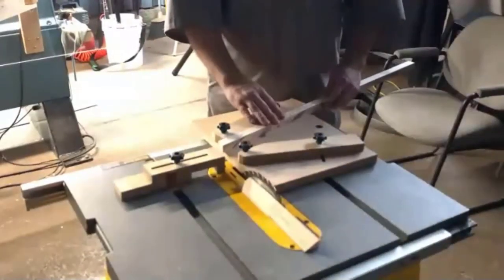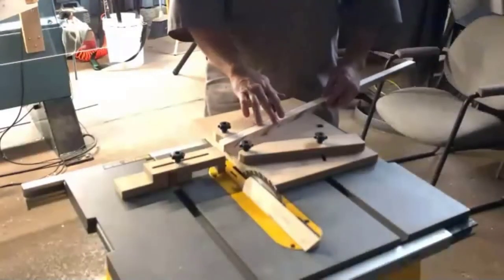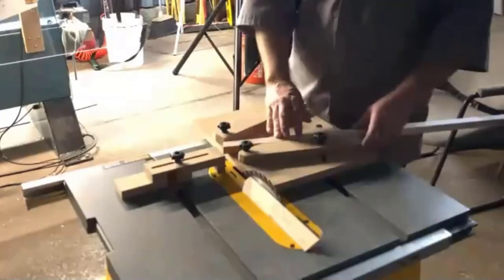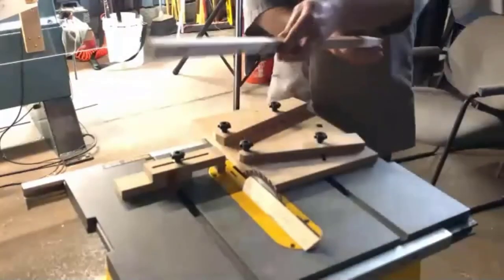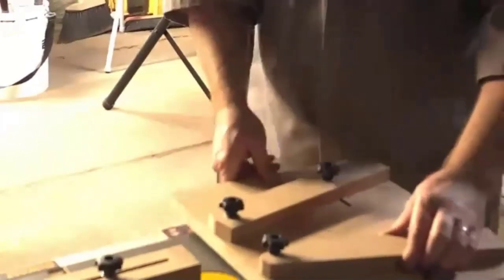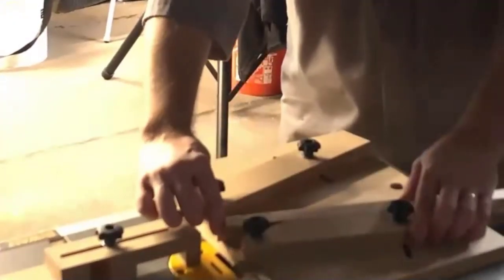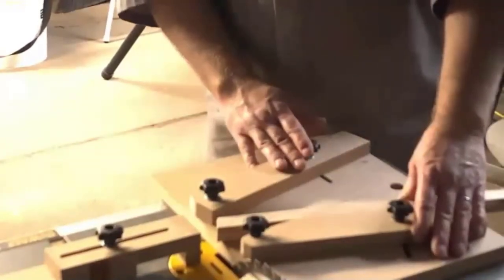You can also just shift on the inside fences, but I have found that because you need this relief cut, this right here, this allows you to have wider pieces of material. You don't have as good of support. And what happens is when you're cutting on this side of this face, your board can kind of wiggle around here and it does affect the angle slightly.